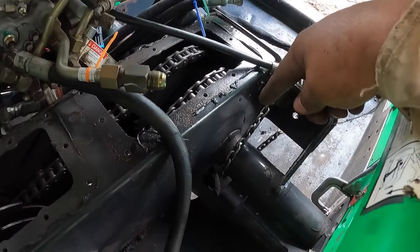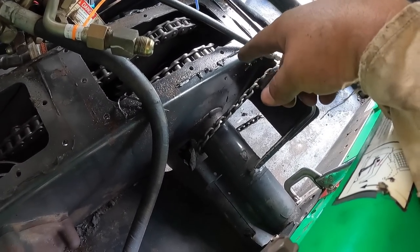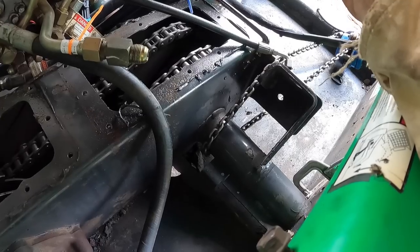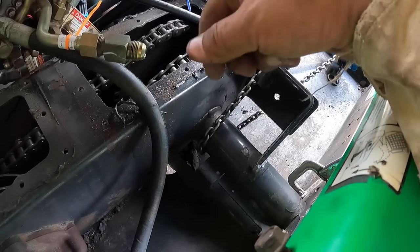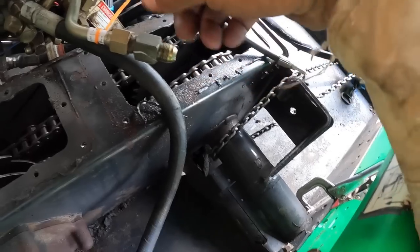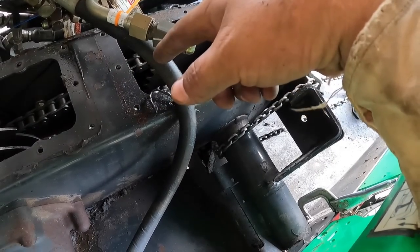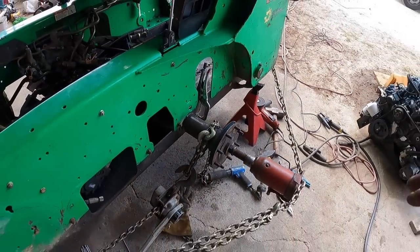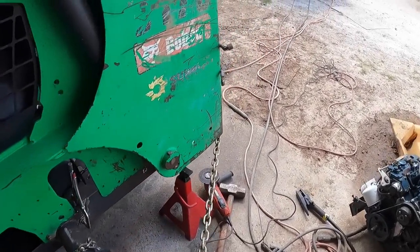Okay, so after all this contraption, we're stuck. This little guy has a shoulder that's sticking out a little bit. The axle tube is slid out about a strong eighth of an inch, but that's more to weld onto, right? More a fillet weld now. So he's happy with the chain tension there, and that's pulling it backwards that way, so I think we're gonna be good. So we'll just call that good and start welding on it. It's more aesthetics, I guess, for now.